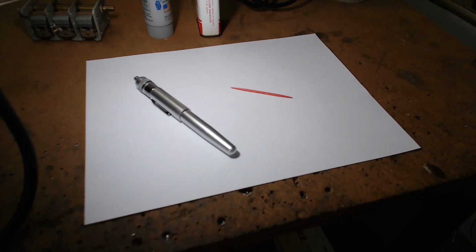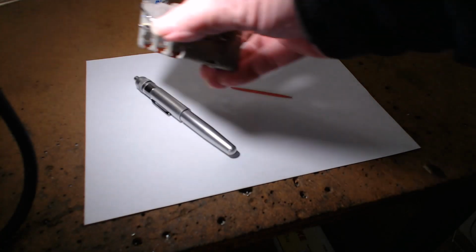If you're lubricating a BC348 or other command radios, you're going to need both grease and oil. Normally, the BC348 or the command radios use grease. But you're coming in after it's been assembled, and in a lot of places you just want to get a little oil down into certain places to get it working or free it up again. And they all have multi-section capacitors like this.